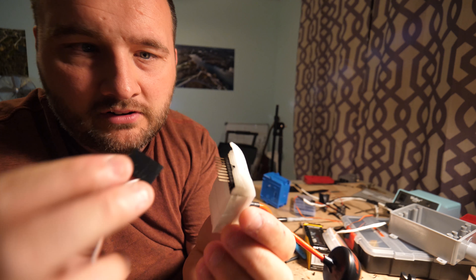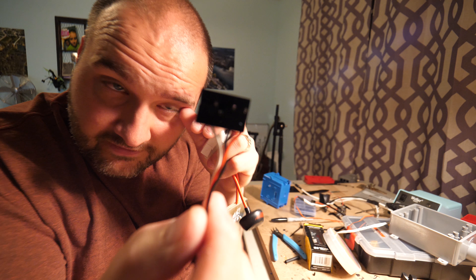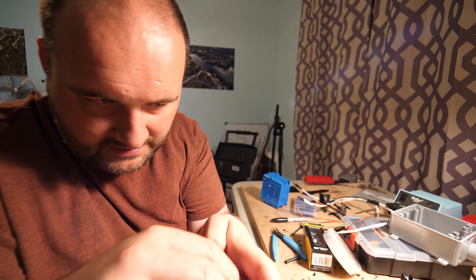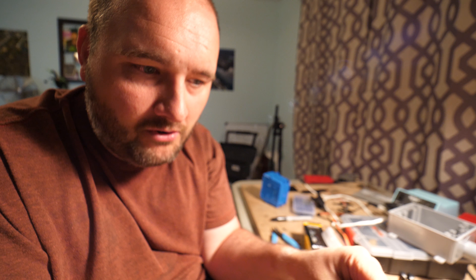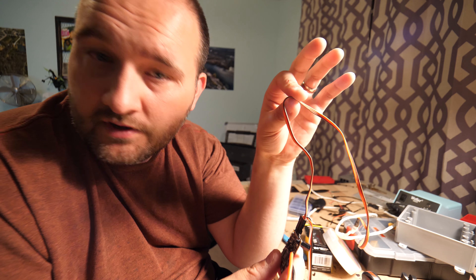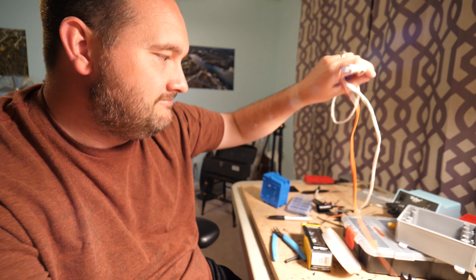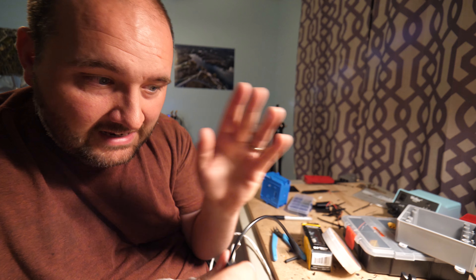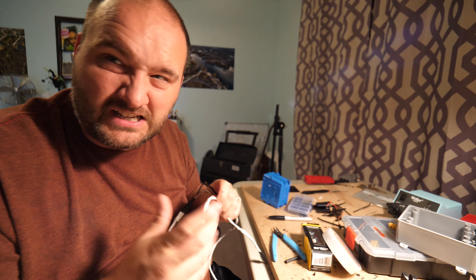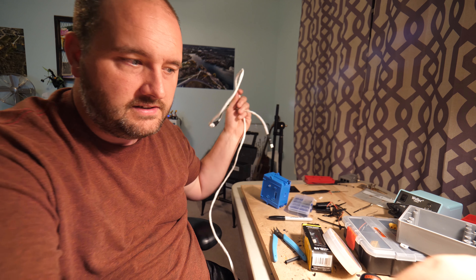I've got this gigantic servo connector — I got the wires in the configuration they needed to be, so it's literally just a matter of plugging that in. It runs to a little servo cable configured the way it needs to be, with some pins soldered where I needed them. I've got the video feed from the diversity receiver going to the power distribution board, and then another servo cable coming out sending 12 volts, ground, and the video feed out to the goggles. On the other end I've got the video cable for the auxiliary in on the goggles and the power adapter. Literally all of this was stuff I had laying around.